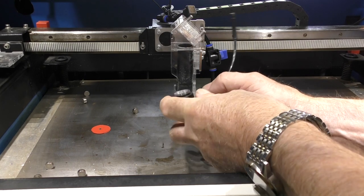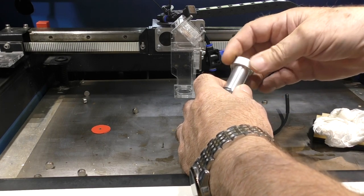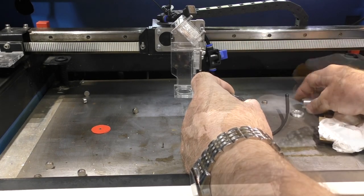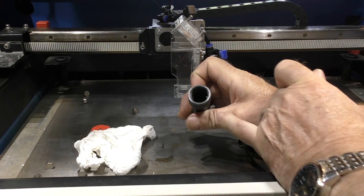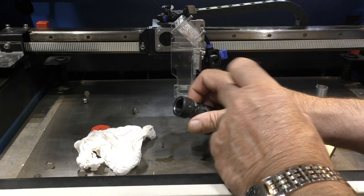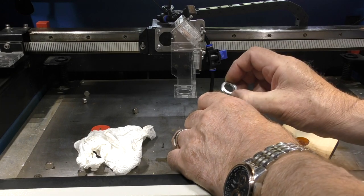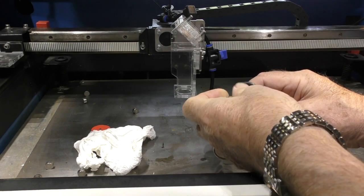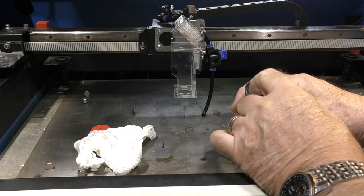Now, today, I'm going to be able to use this. Instead of my lens being in this lens tube, I'm going to take that same lens, which is a 20mm lens, and try to pop it on the top there. The advantage of doing what I've done there is that I should be pulling that lens forward by probably 8 or 10 millimetres. Now this is where you can play tunes with this lens ring. I've got a lens ring set back there, and on top of the lens ring I've put an O-ring. This is a split O-ring so that it comes out nice and easily, but it performs the same function of cushioning the lens.